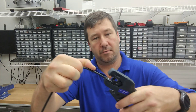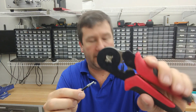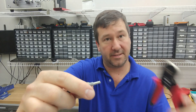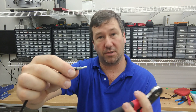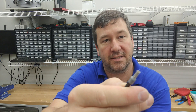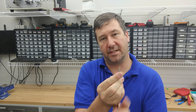For our smaller wires we're going to use our strippers — either automatic or manual — and we're going to use one of these ferrules on each wire. It simply slides over the wire and then you crimp it with a ferrule crimper. Don't take your wire strippers and try to pinch it down. There is a tool designed exactly for this — invest in a good one, because some ferrule tools are so awkward that your hands will be sore at the end of the day. You just put it on, crimp it, and you can see it's a nice crimp connection. The main reason for using ferrules is so that you don't end up with little whiskers coming out of one wire and shooting over into the next terminal.